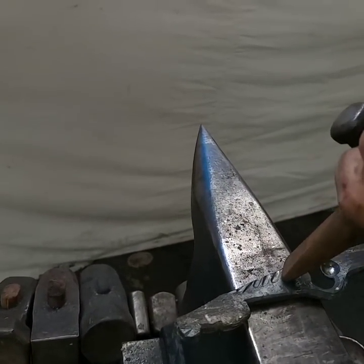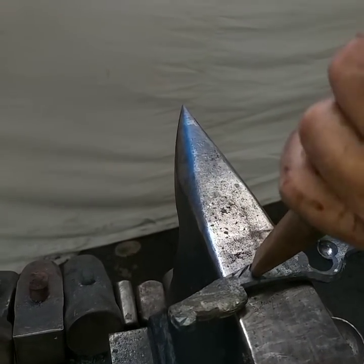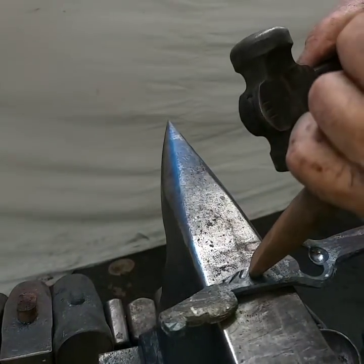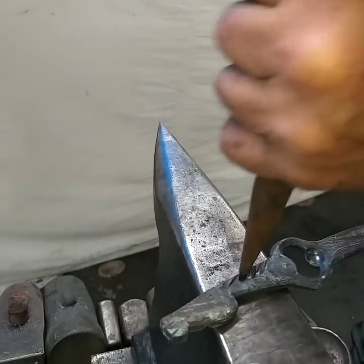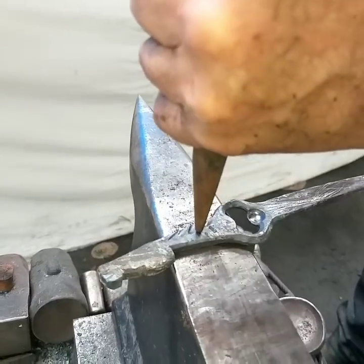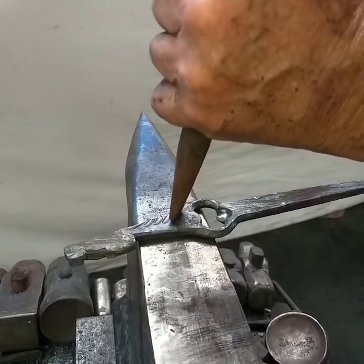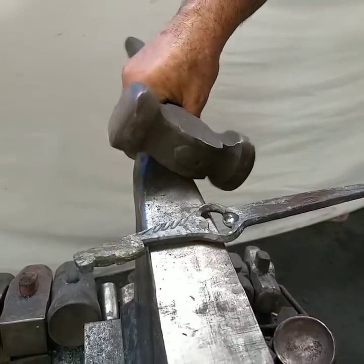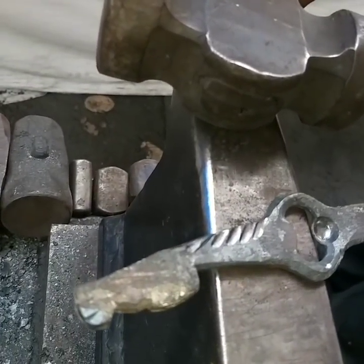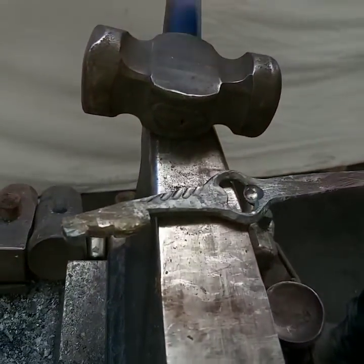And yes, do them at the cooler temperatures. That way you can feel instead of find. You bring a heat out and you have to find your marks, chisel marks, fuller punch marks. You'll probably lose all your heat before you can find the right spot until you get real good at it. But even if you're good at it, it makes a lot of sense to lay out at the cooler temperatures so you can feel them instead of find them.